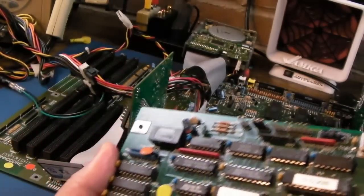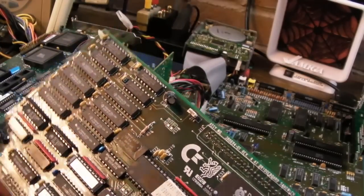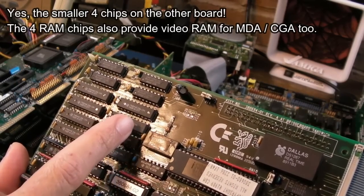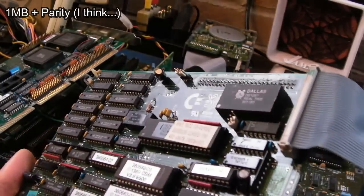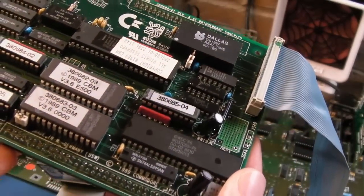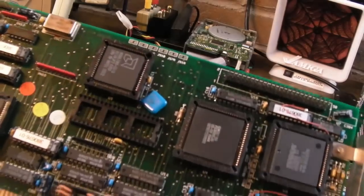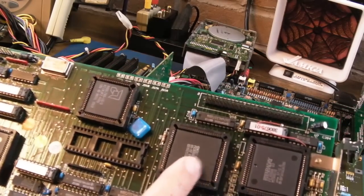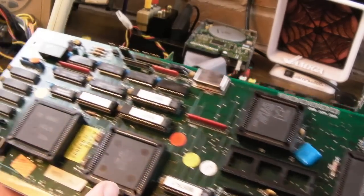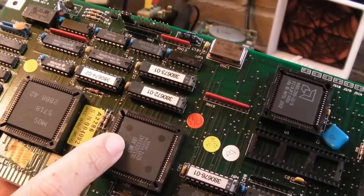RAM is going to be a limitation. We've got some RAM here - one, two, three, four RAM chips there, and then some RAM on the other board. Some of this may be for interfacing between the Zorro side. That looks like a 44256. There's also what looks like a delay line, the real-time clock, and a floppy controller - WDC, Western Digital. Over on this side we've got a couple of Commodore ASICs - MOS 5718 and another CBM-ABT.